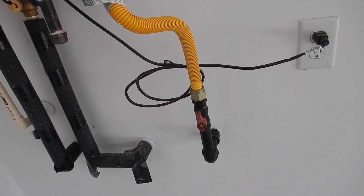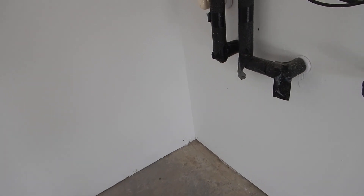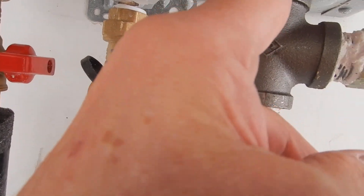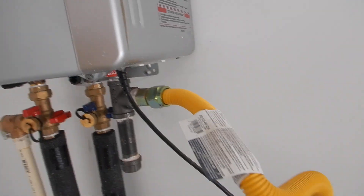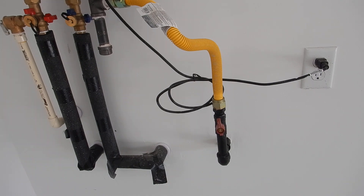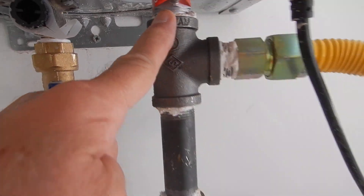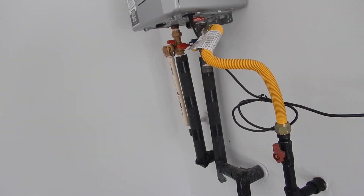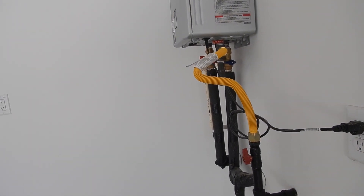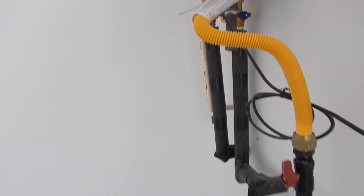See this red tape right here? That indicates to me it hasn't been molested. The builder of this water heater tank knows about how much pressure is coming in residential and they get it close. You can bolt this up and use it, but until you take that off and put a manometer on there and dial it in perfectly, it will likely not perform at optimum performance. It may be set correctly for all we know, but we don't know because they never put a manometer on it. It's in the instructions — the instructions that aren't here.